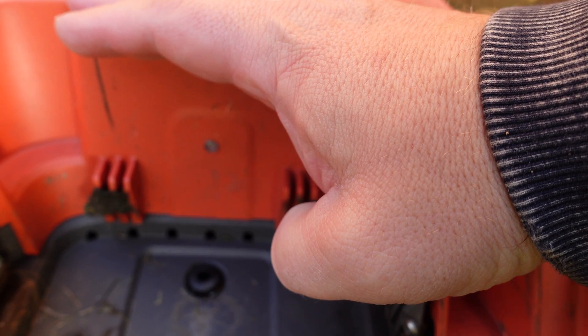I've put it away for winter anyway, but I noticed — and I can't really show you too clearly on this video, though I might do an overlay — there's a little blue light flashing on the base unit of the mower, basically saying there's a cable connection problem. It's been three years since I laid the boundary cable, so the ground has grown over it. In this video, hopefully I'm going to show you how you can easily find your broken boundary cable if you have a similar problem, with a little AM radio.